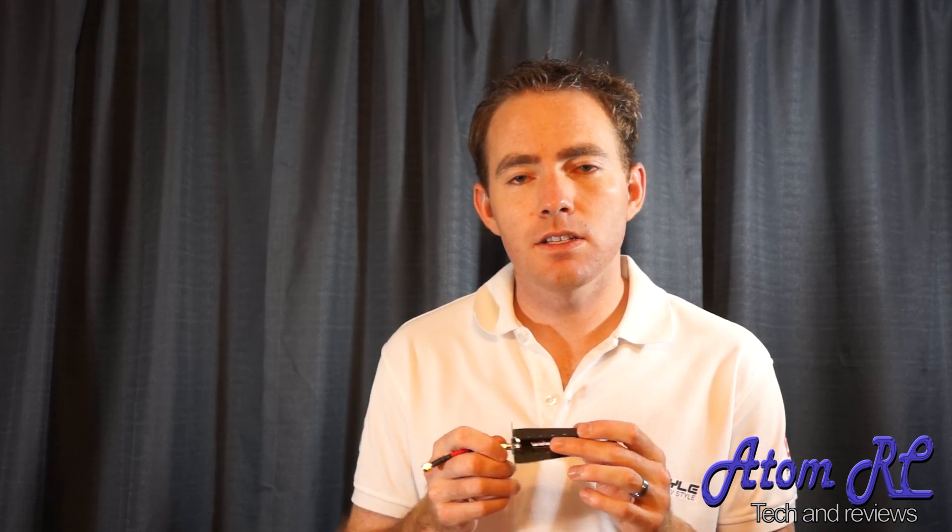But if you just want to go for some long range, or know that you're flying through a certain area, you can definitely set up your ground station, aim it right there, and enjoy the flight. It's not a complete cutoff on your video if you go outside the range — you just start losing signal more. That is one thing to watch for when you start getting into these higher gain antennas: it does start narrowing down your focus.